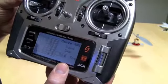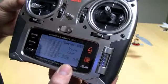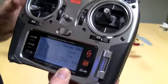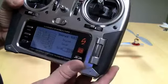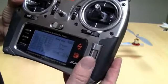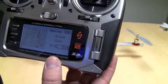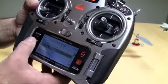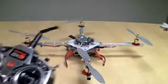That's if you switch the gear switch, and that's to enable auto level — this will be the gain when you enable the switch that is used in auto level. But we're not going to go through that in this video. We're just doing basic flying today. Whichever position — this is the zero position, off. That's the position we're going to use for our primary gain, and I've got that set to 50%. Everything's set up correctly now. I can go back, and I'm ready to turn on the quad for the first time.